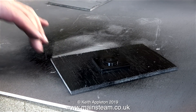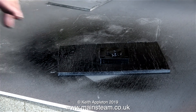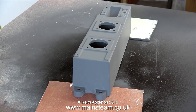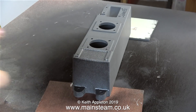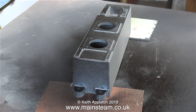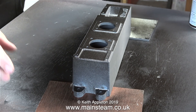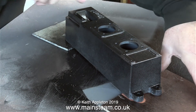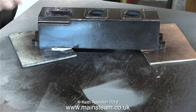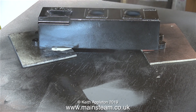I'm painting the base of the cylinder using HMG enamel paint. HMG paint is really good stuff — I first found out about it when I worked at the steam workshop. It's a spray enamel, really durable, very easy to apply, and you get a good finish, provided you don't put too much on — any paint will run if you put too much on. This HMG paint seems to flow together very well, in a very similar way to Phoenix Precision paints, which I also use very frequently. You paint it with a brush, you can see the brush marks, then you leave it, come back the next day, and all the brush marks have disappeared. But as you can see, I'm not brushing this part — I'm spraying it. Why? It's just quicker really.